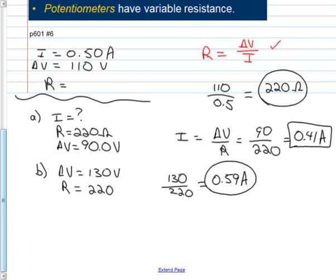I can burn out electrical components with that much energy force trying to push those things through. So I called up the power company, and they came and checked the transformer that's sitting out there. You know those barrel-shaped things that you see sitting on poles? Those are transformers. They come in at higher voltage and step it down to 220, 110, 120, somewhere around in there. That had gone bad, and it was letting too high a voltage into my house, which would have been really expensive if I hadn't noticed that the lights were too bright when we were getting ready one morning. So I was very thankful for that.